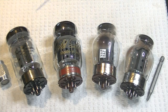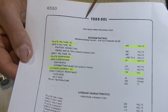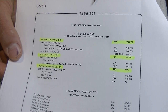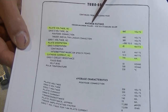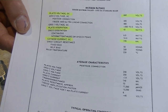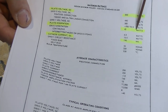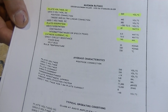Next, the 6550. This is the original Tungsol, not the reissue. Tungsol invented the 6550 back in 1954; Philips invented the EL34 in 1949, and Philips owned Mullard - that's why we were looking at the Mullard data sheet. Plate voltage DC is 660V, a little lower than the EL34. Plate dissipation is 42 watts - quite a bit higher than the EL34. Cathode current is 190 milliamps, just a little higher than the EL34.